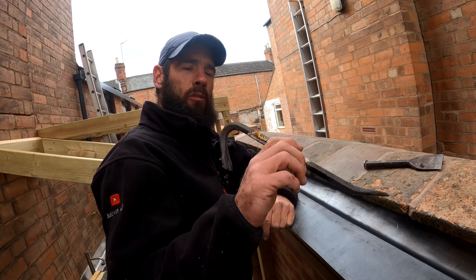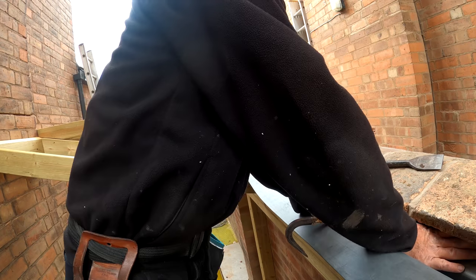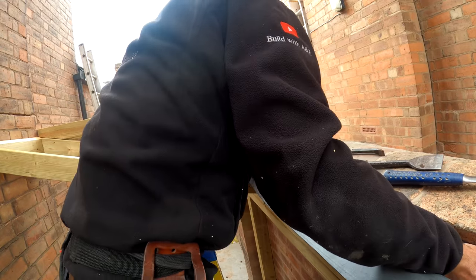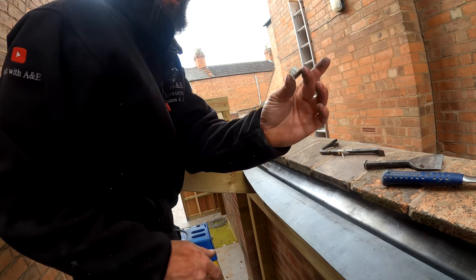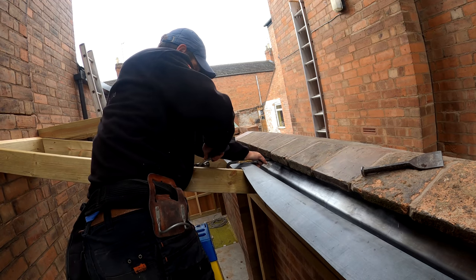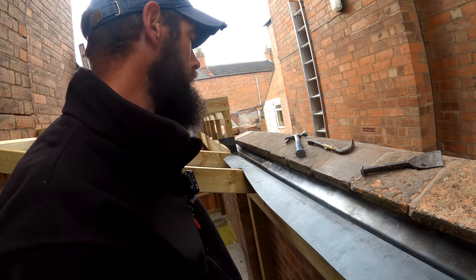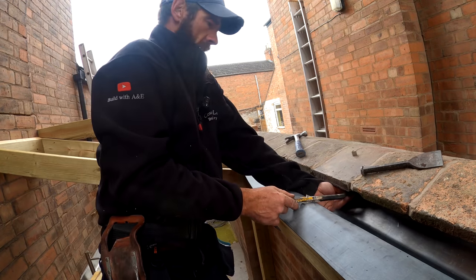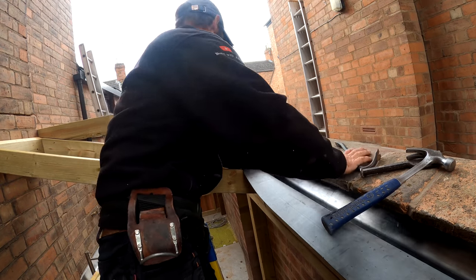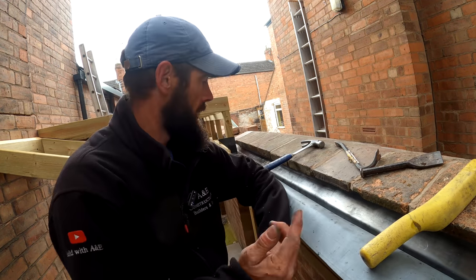So I am going to use a mini little crowbar. I'm not getting it in from the end first — I want to get one in here first. So push the lead in tight like so, put the crowbar where I want it to go, and knock her in like that. So that's one side in — this side shouldn't pull out when I'm pushing this side in. Going to get another clip, get underneath here, push it in tight. Got one clip there, got another clip here. Because of where it is, let's put a few more in, shall we — just to be safe. And just like that, that's how you get the lead in.